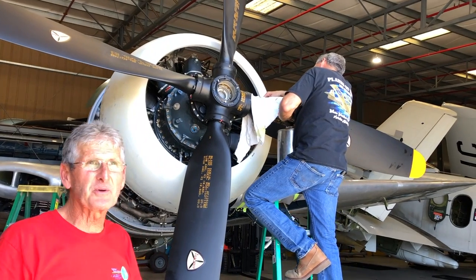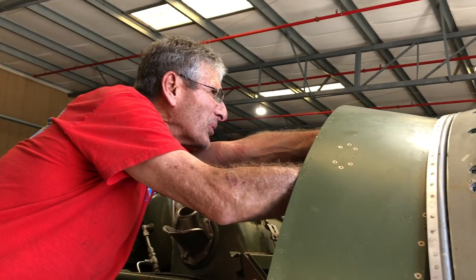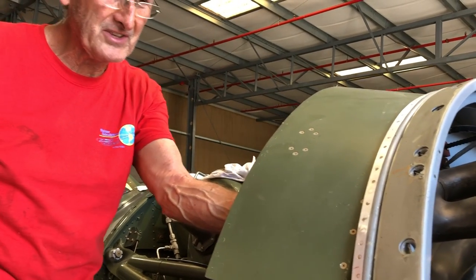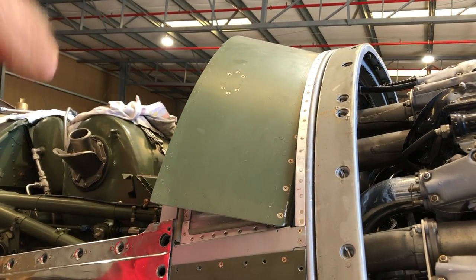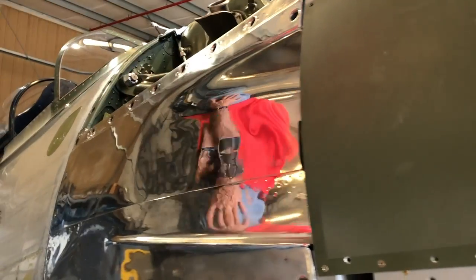We should be running the engine pretty soon. It hasn't run since it was overhauled by Anderson. Right now we're putting in a number-10 bolt and nut on a cowl flap hinge — not permanent, just fitting all these parts. The cowl flap regulates air going through the cowling. When it opens, it lets air out — everything coming in from the front goes through the engine in this area — that regulates airflow and controls temperature. We don't have the cowling on right now but it would still be rattling.